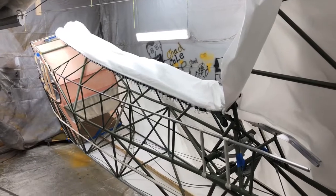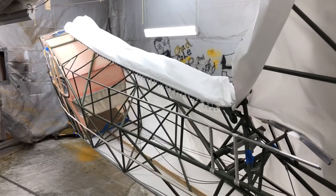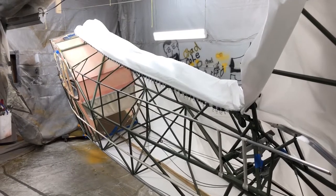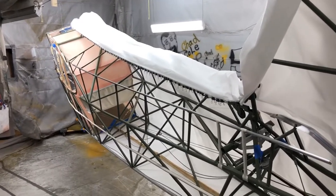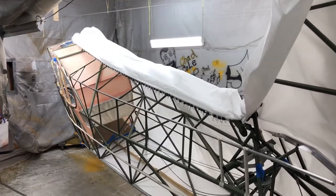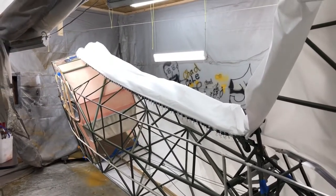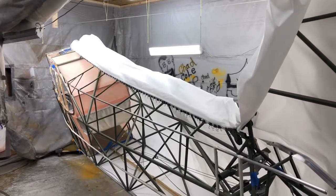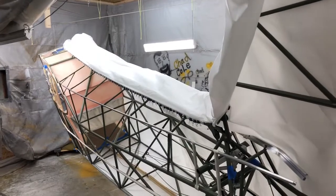Then I took a little grinder and cleaned up the edge of the formers. I was gonna braze some more crimps on to put these aluminum Univair stringers on. The plane's kind of cockeyed where I just got through gluing that seam up — I've got basically an envelope without the bottom in it, but it's only one seam on the spine stringer.